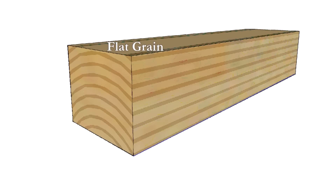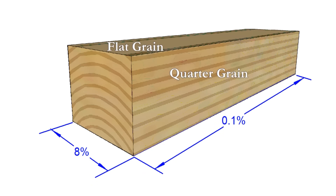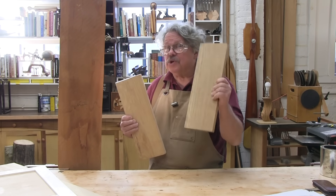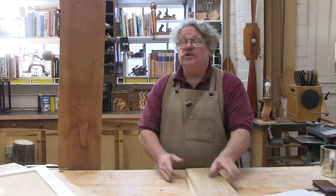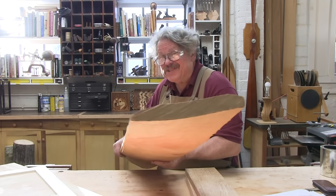How much does it move? Wood is fairly stable parallel to its grain direction — an 8-foot or 2.5-meter long board will move less than one-eighth inch along its length, only 0.1% along the grain. However, it will move 8% of its dimension across flat grain and 4% across quarter grain. This is why woodworkers consider quartersawn lumber much more stable than plainsawn, and it's also why wood with mixed grain warps and twists as it moves.